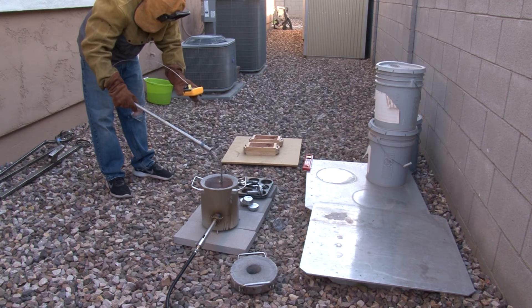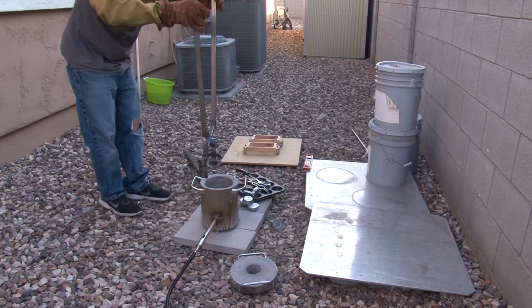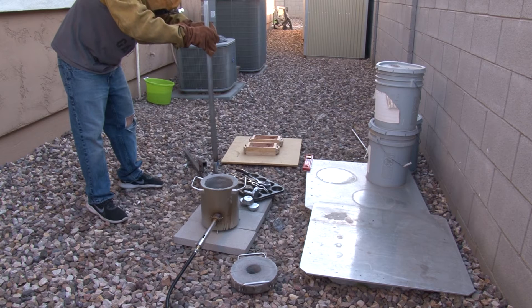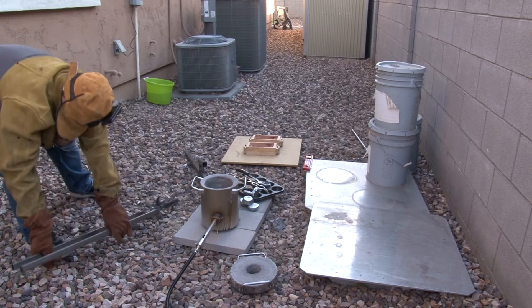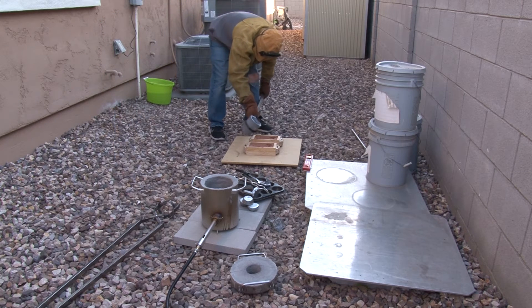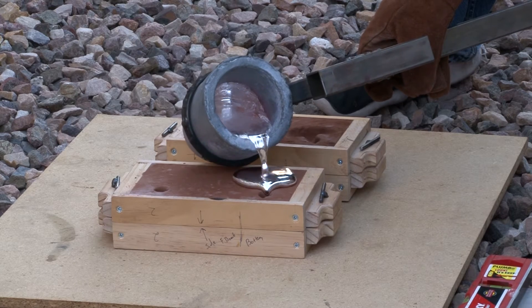This day sucked — it was really windy, and every time I heard something flop around I'd get kind of scared, hoping nothing would fly into the furnace with the molten aluminum, because you don't really have good peripheral vision when you wear that mask. If you cast aluminum, make sure you get your protective gear on because it only takes one mistake to really wreck you. These furnaces come with little salad tongs — I use them to drop aluminum into the crucible when it's hot, but you really need a nice pair of tongs; don't mess with the salad tongs that come with these kits. I went ahead and packed up two molds.